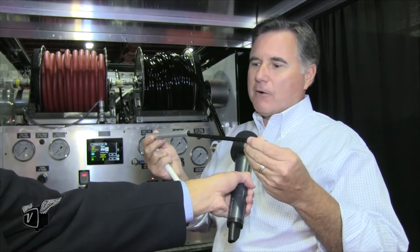It really does work. What's so unique about it is we take the core out of a hard line coax cable by pumping in a soap — basically a fluid — into the end of the coax cable. What happens is we're able to compress the dielectric foam core and push the core right out of the end of the hard line coax cable, which leaves behind a nice tube or microduct that we can then blow a microfiber cable back through at exceptionally low cost.